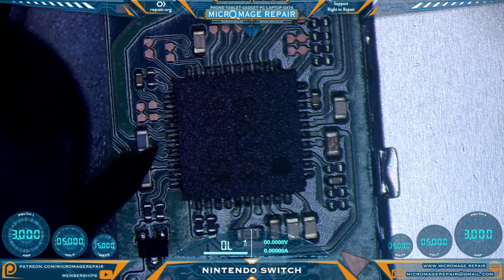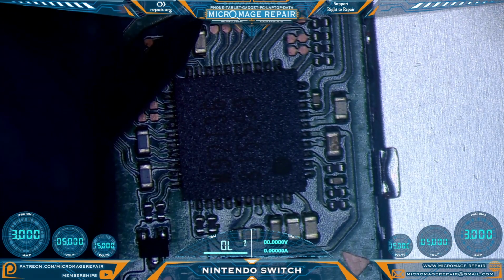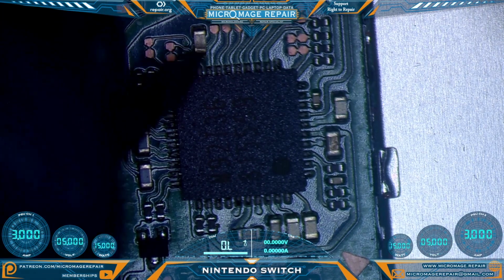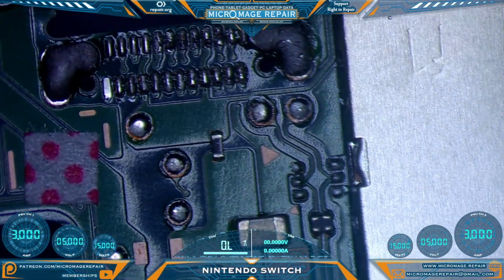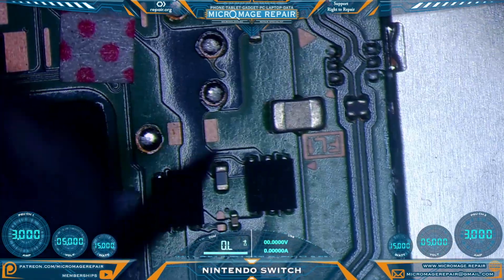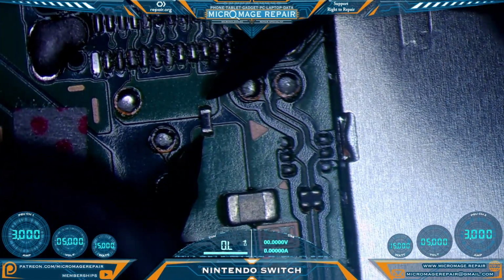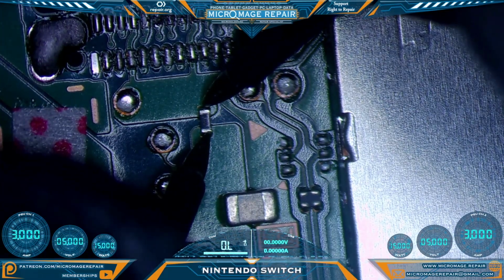What other issues will we have here today? Let's check this CPU capacitor and see if this is even going to be worth continuing with. Very good, at least that one's not short. A host of other problems, but at least that one's not short. Let's check our MOSFET area, and nothing shorted there. We'll check our invincible fuse, which clearly did not do its job.